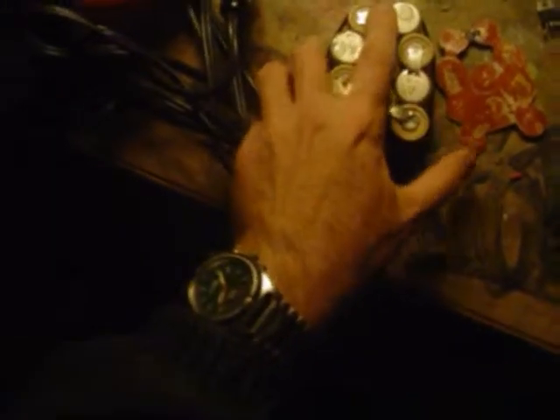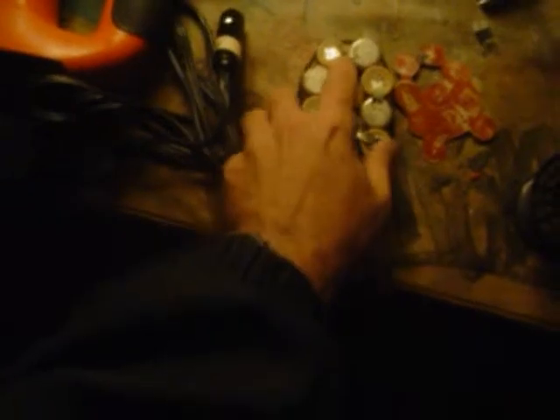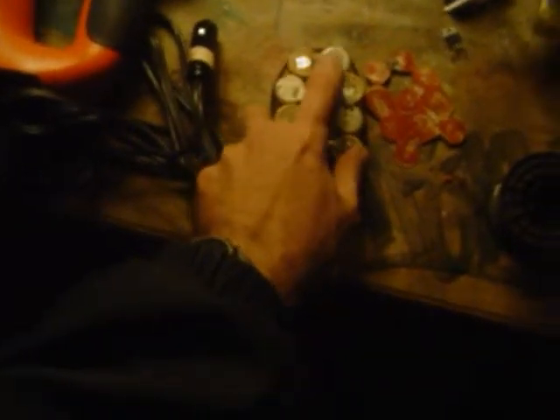So I took my alligator clips, clipped that back together, clipped it onto the battery, and the unit fired up. I plugged this into the charger through alligator clips and it took a charge. So now I'm going to solder a wire across there, put this battery back together, and see if I have chargeable batteries and the unit working again.